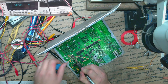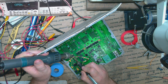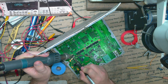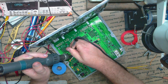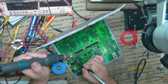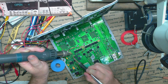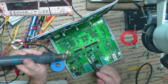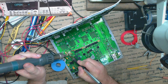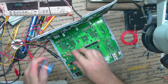This one is going to be a little bit harder to clean up because there's so much thermal mass here. I'm going to use hot air and my soldering iron because there's a lot of solder globbed up and we don't quite need that much. I accidentally got this stuck to the ground plane, which is connected to the case — it's up now. There's a little thing right here and I think it's some kind of weld from the PCB to the case because it's not like a normal joint. I want a little bit more cleaning here.